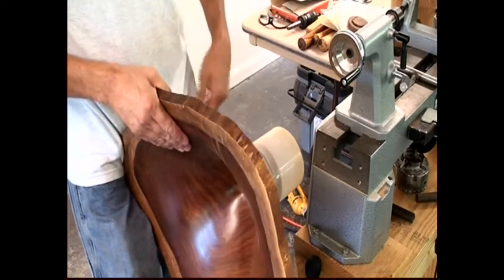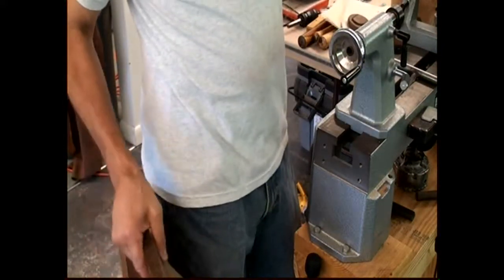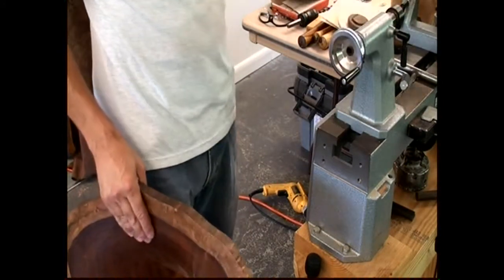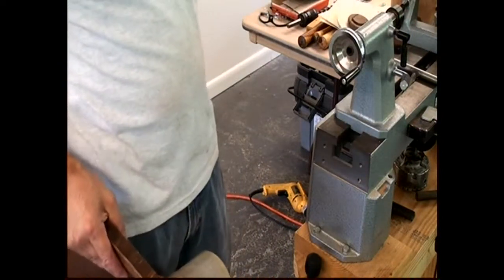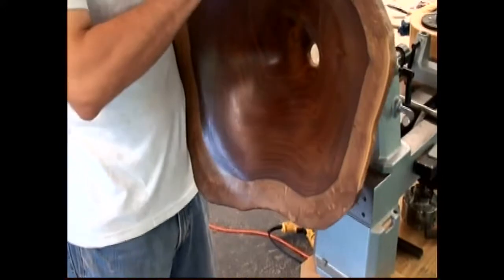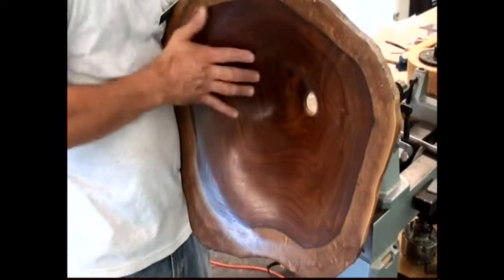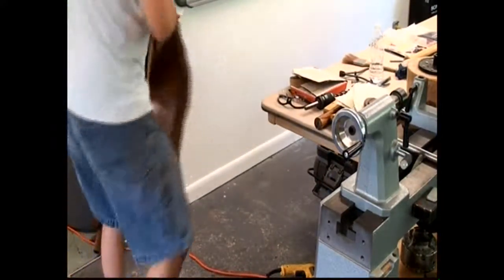And I think some of you saw those pictures I sent when I had those 8-9 foot long beams I was turning. I borrowed my buddy's Powermatic bed. I left the headstock at his house and the tailstock. I took his banjo so two of us could be turning on those long beams. And when I was done with that, I separated the two beds and I put this on my headstock and had his tailstock over here, because I still had the center post out. And that strengthened it enough so I could cut about all the way down this much and come up and clean all that up. And then I took the center out and moved the lathe and just did it that way. Is your lathe bolted to the floor?